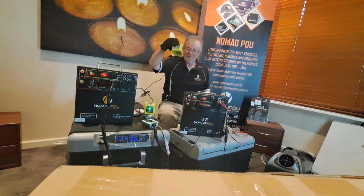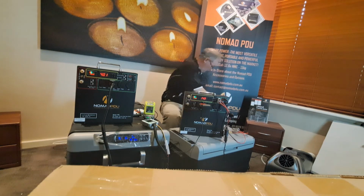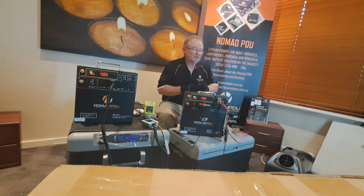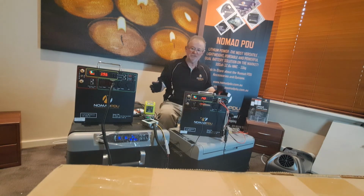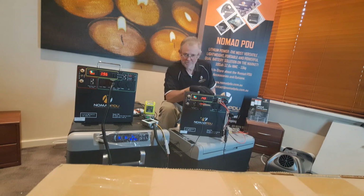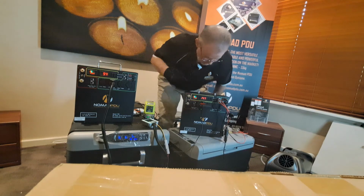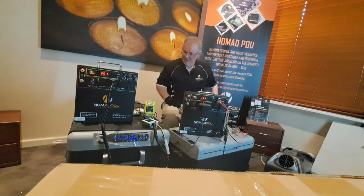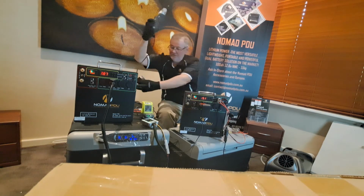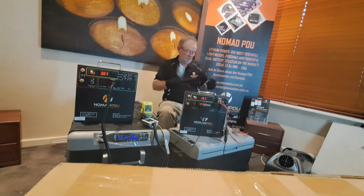So I can put another one in there if I want to with another inverter. And listen, I just want you to understand that you can go as crazy as you want as long as you understand the amount of load you're pulling out. I'm not going to exceed 20 amp from the units, any of the units. So that guy over there is 3, this one's 14. If I wanted to right now, I could take my Dremel, and this is only a 160 watt Dremel.